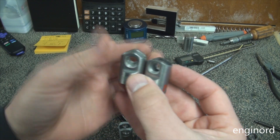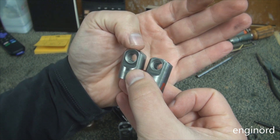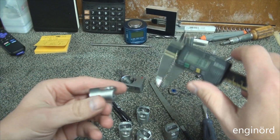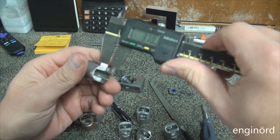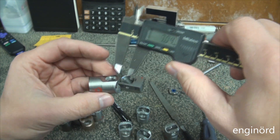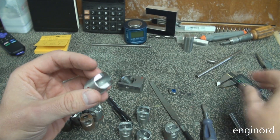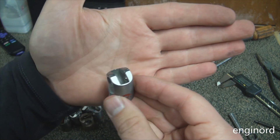Some of these do have the necessary depth. You can see this one has kind of a crowning - this end is not cut to size yet. The size should be around 3.71 and it's measuring 3.68, and 3.74 on the other side. So it's not uniform but it's fairly close.